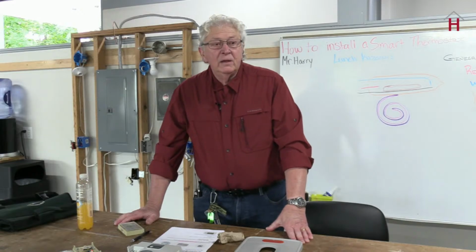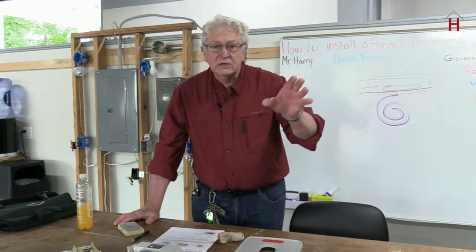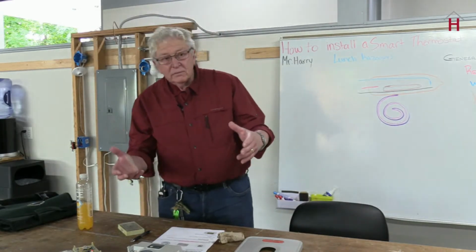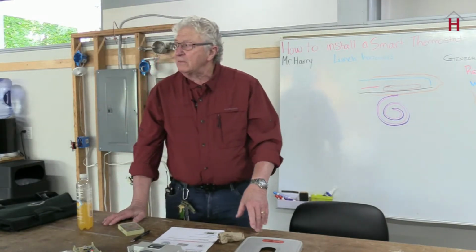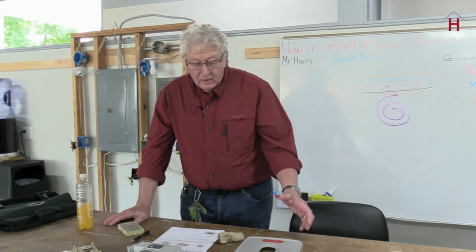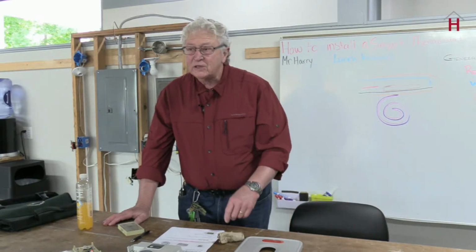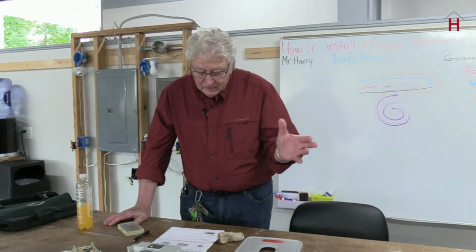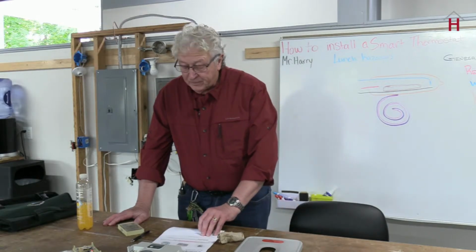Most of them are what's called a 5-2, which means that you can program it for 5 days a week and 2 days a week. A daily or a weekday and a weekend setting, which is when things sometimes end up changing. Programmable stats, other than the fact that they can be somewhat convoluted in programming because you got to push this button and push another button to get time and so on, that's about the hardest part of them.